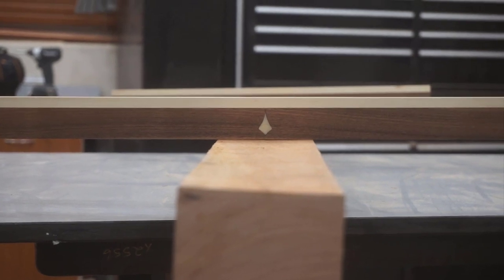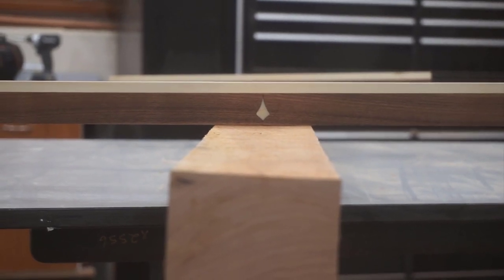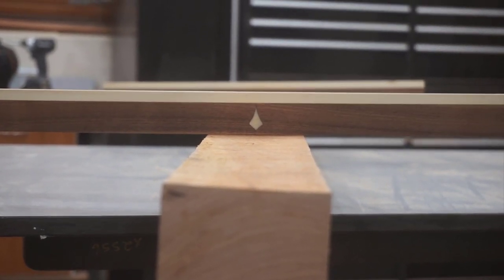And remember, the amount of twist is amplified by the length of the sticks, so a little bit of math is required to determine the actual twist. But over this 30-inch section of this piece, I'm guessing it's about a strong 16th of twist. And that's too much to have in any part of a door or a door frame, so it needs to be planed out in the milling process, or it'll be a fight all the way through the project.